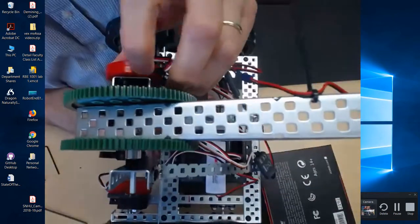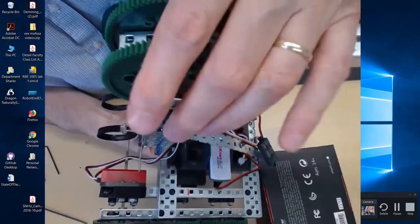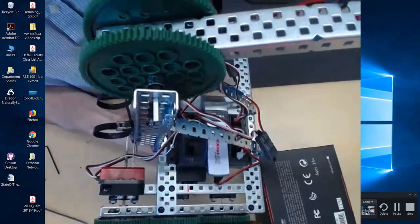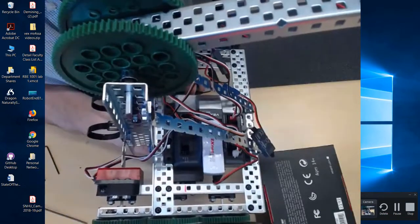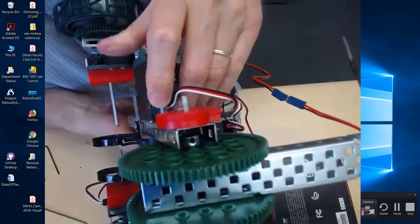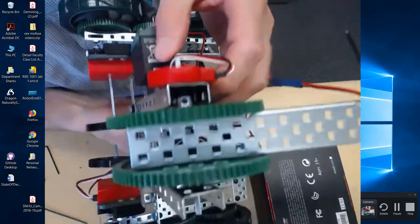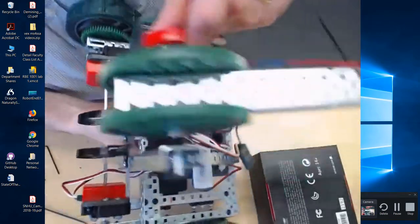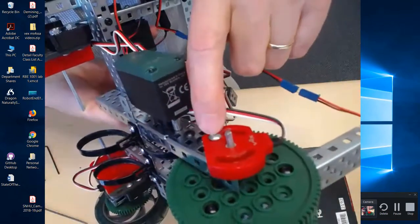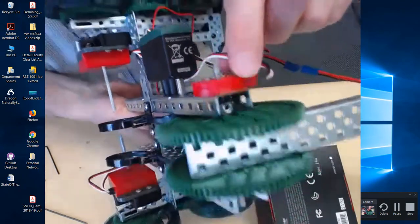So you can see on the top. So that all goes together like that. And then we have another 4-inch axle that's going to go through on the top, and you'll have this bearing on the top, on the inside. So you don't want the potentiometer to support the axle, right? So in other words, we're going to have a 7/8 screw that goes through the bearing on the top part of the bearing, and that's going to hold this screw right here. So that's going to be our adjustment for the encoder. Okay, that'll be our adjustment for the encoder.